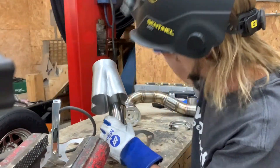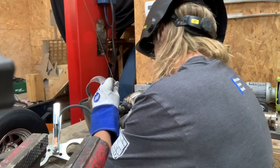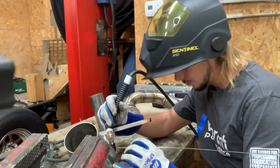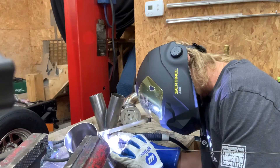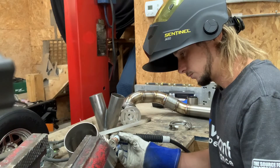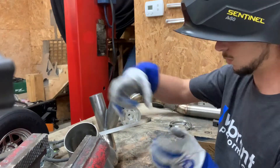Getting them all tacked up makes it look like you can rip through headers real quick, but once you start fully welding them out, it's a pretty lengthy process. This collector is actually kind of spread out a little too far - I really need to tighten it up, because the primary doesn't even fit in there real tight. It's like it needs to be pinched in the corners - the four corners a little tighter.